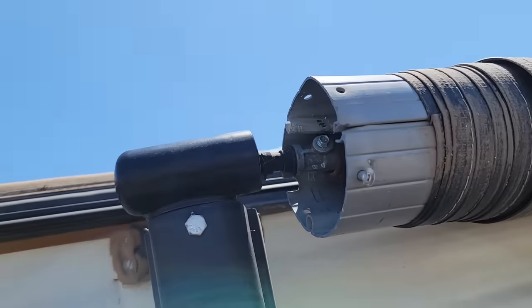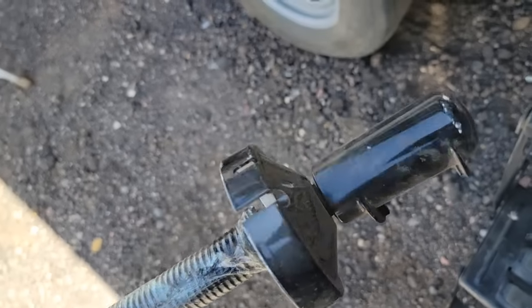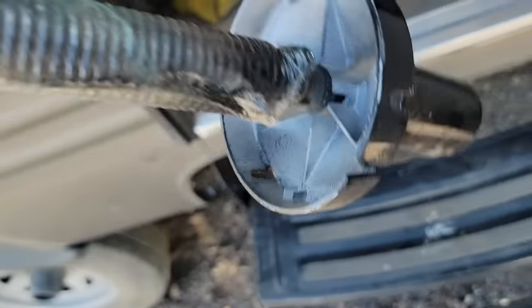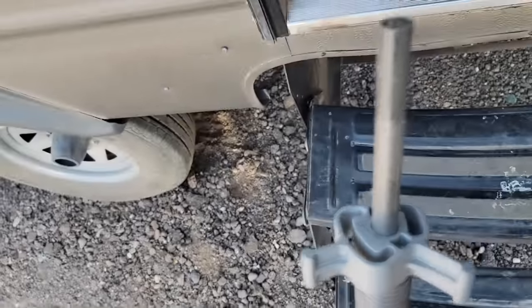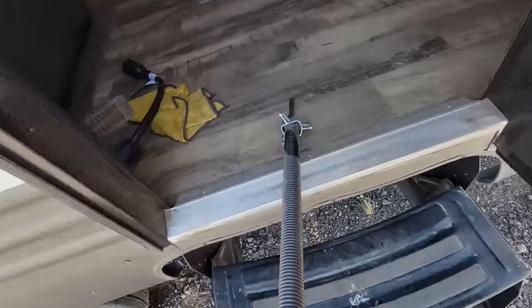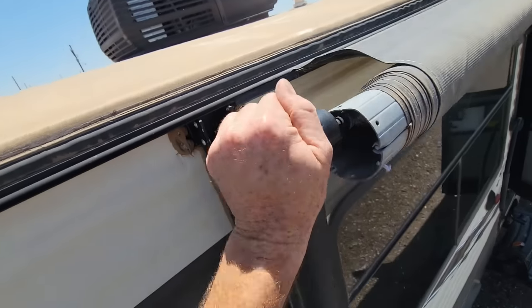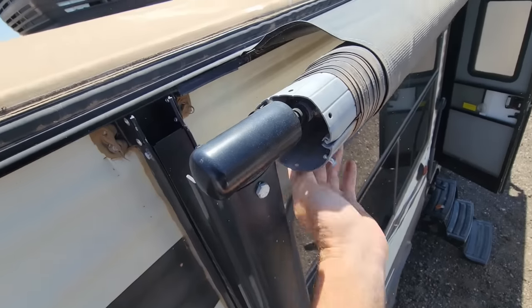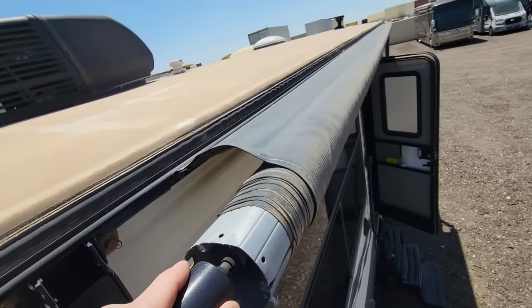Now I didn't completely explain the anatomy of this spring. This torsion cap is missing because it's cast aluminum — hopefully you can see the casting in there. So once it breaks, it's brittle just like china and falls apart. It has a steel rod going through the middle of it, which you can see right there. This part will lock onto the profile inside the tube there. So when that engages the tube, it'll lock it into place, and as we twist this end, it'll add tension to the spring. We need a little bit more slack than this because we have to lift the tube up out of this arm there, so we need to have enough slack on the fabric to do that.